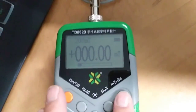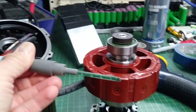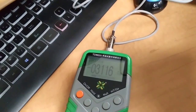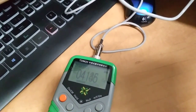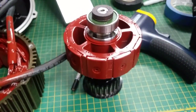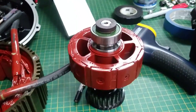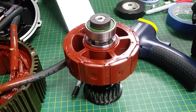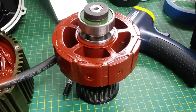Now, time for magnetic measurement. This is a small Hall sensor — the goal is to measure the magnetic field. Normally there's about 4,000 gauss; I measured 4,200 gauss on this location, which is about the maximum I've measured. That's my baseline, because this motor was never overpowered. I will compare this baseline when I use the back EMF at 8,000 to see if I de-magnetize the magnet past the Curie point — the maximum temperature without having irreversible effects.